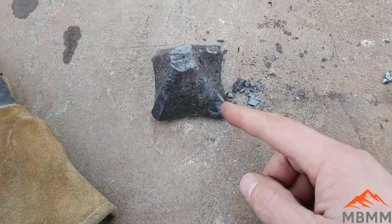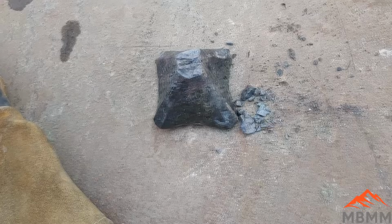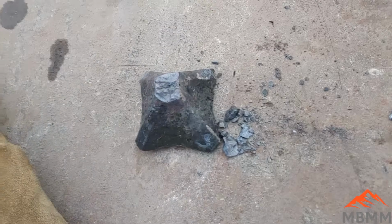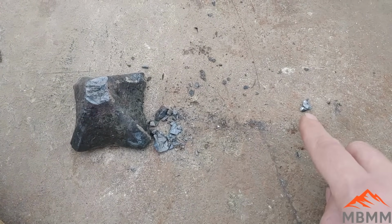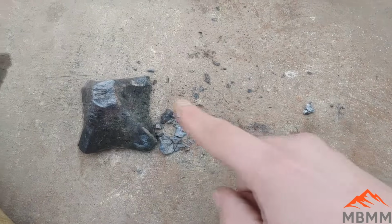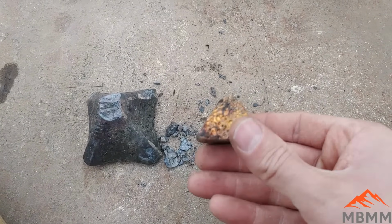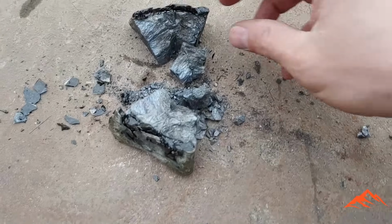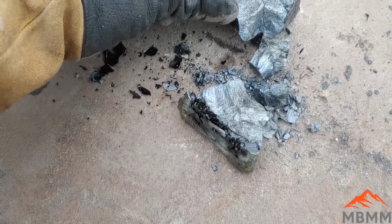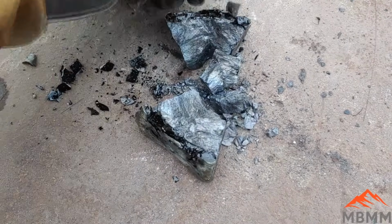And now I'm just going to mix a whole bunch of nails in here. I don't know, we started with 200 grams of stuff, so I'll mix like 150 or 200 grams of nails in here. We'll smelt this down, and we should end up with a cone that looks something like our copper cone from our first smelt. The theory with this whole experiment is if you can get the precious metals out early, take the sulfides, reprocess them to get the copper out, then you don't have to go through the electrowinning process to get your precious metals. So let's try it. And then here's what it looks like. I just broke it open. There's all our sulfides and a little thin layer of glassy slag on top, which is kind of interesting.